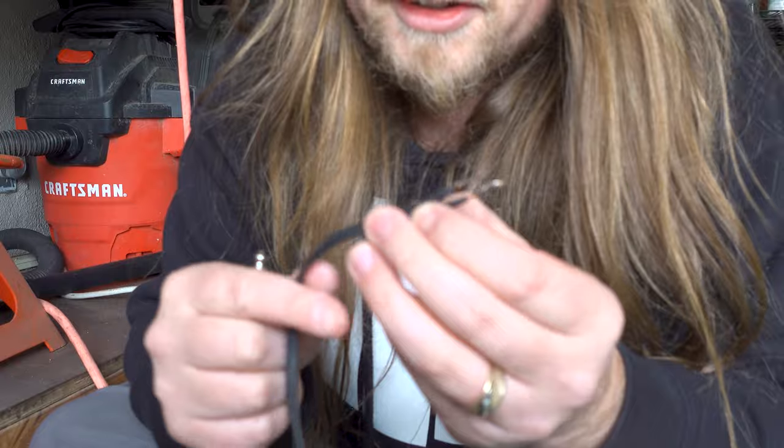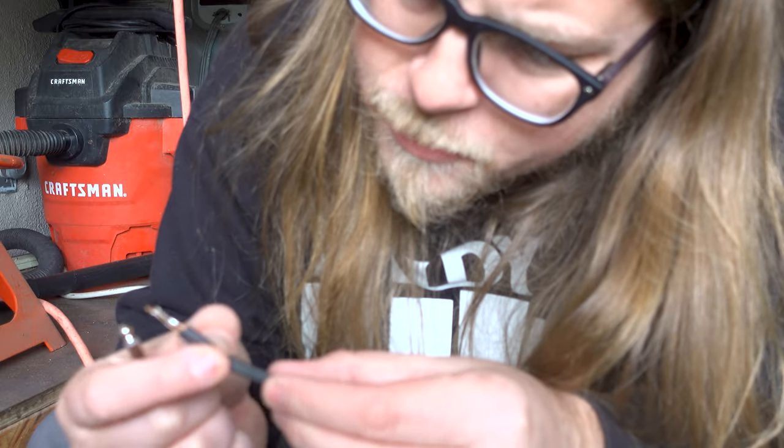This is clearly just like a lamp cable that somebody else soldered onto this thing like 50 years ago. Usually the convention is rib side is positive, and I'm just going to go with that. It doesn't really matter unless I'm plugging more than one speaker into the same amp. If I do that and they're out of phase, it'll sound kind of shitty. And if I find out that they're out of phase, I can fix it. Otherwise, I kind of don't care.